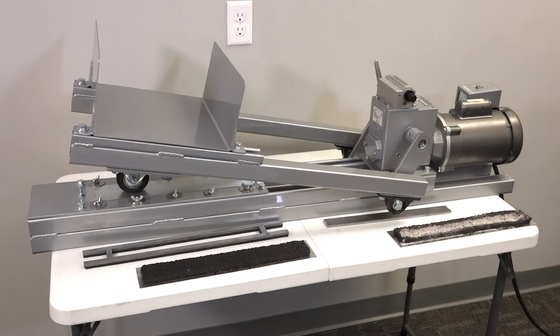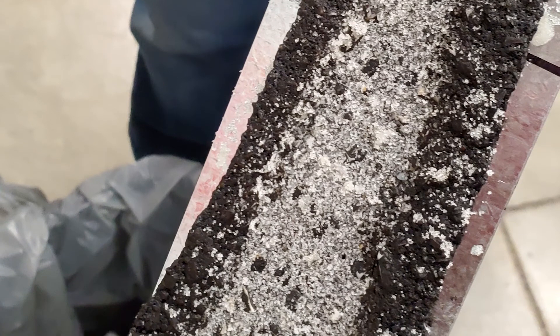In the other two tests — the cohesion test and the wet track — one can usually achieve better results with higher asphalt contents. However, too much asphalt will lead to flushing of the mix, where traffic compacts the mix and excess asphalt bleeds to the top, creating a sticky mess on the road surface. In addition, the deformation of the sample will further indicate how the mix will perform under traffic load.